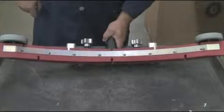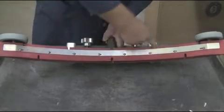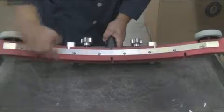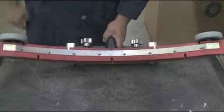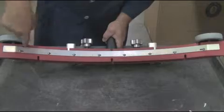The front squeegee has 2 different sets of air inlet ports per side. The top has 5 inlets and the bottom has 3 inlets. This squeegee can be flipped to eliminate squeegee cavitation depending on the type of floor surface you are operating on. Regardless of the surface, the squeegee will be able to be set up based on your floor application.